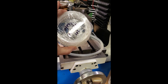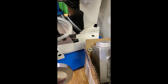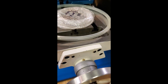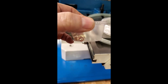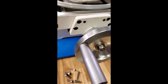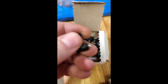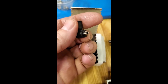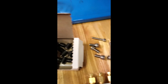Then, four millimeter same kind of hose — I got another roll on order. It occurred to me that 20 feet wasn't going to be enough. Some adapters that I made up, threaded five millimeter, and they push in place of the ball oilers. Finally, some banjo fittings that take the four millimeter tubing, threaded five millimeter with a little O-ring to screw into the adapter that I made. These will go on each oil port — there are 10 of those.